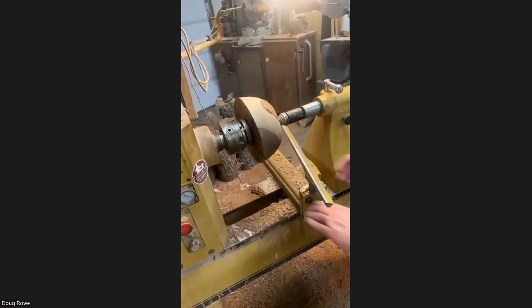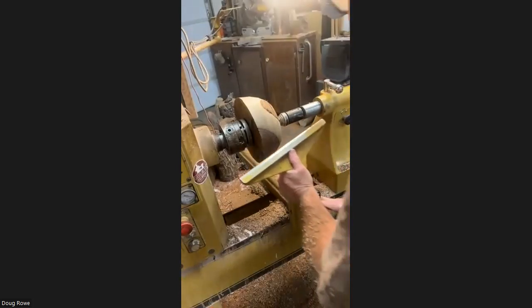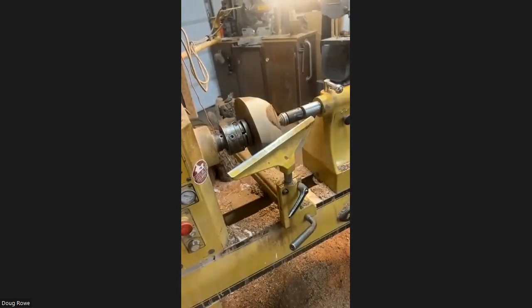Yeah, rule number one on my microwave process is don't use the microwave in your kitchen. There are a couple of reasons. Number one, the whole house will smell like wet wood, no matter how hard you try. And number two, if it does catch fire, it's really hard to unplug a built-in microwave and throw it out in the backyard. One of the guys in my local club, when he was telling us about it, had his microwave in his garage. He pushed 30 seconds, ran in the house to grab his cup of coffee, used the bathroom, and came back out thinking the microwave's definitely off. Oops, he had pushed 3 minutes and his garage was full of smoke. So it happens. Not good.